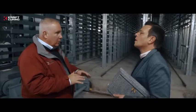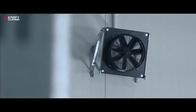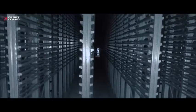So the result of not insulating my house would be high energy costs and mold? Exactly. The second component is air circulation, by which we can guarantee plus or minus one degree Celsius throughout the entire curing chamber, top to bottom and front to back. Without air circulation, the bottom of the chamber is more than 10 degrees cooler than the top, causing the color of the pavers cured at the bottom to be darker than those at the top.